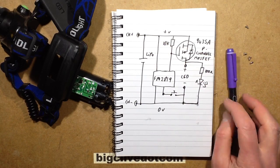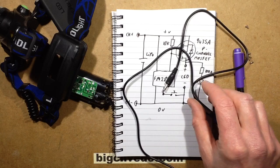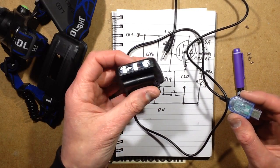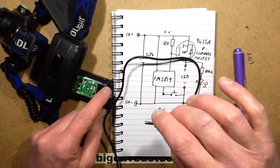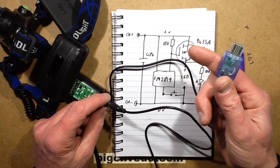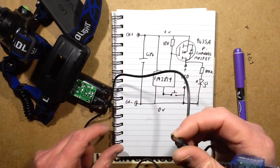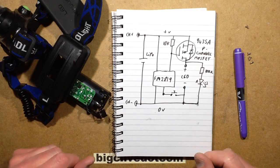The rest of the circuitry is really just the lithium cell over-discharge protection, and the charging contacts connect straight onto that. That also made me realize that this charger from this little clip-on headlight actually fits in there and does the job — it charges the cell. So this little fixed 4.2-volt output charger is all you actually need; it seems to be a standard thing.